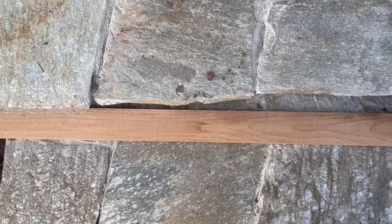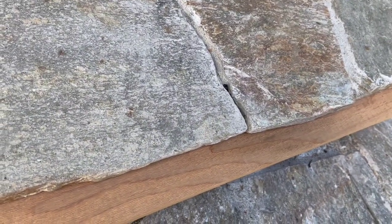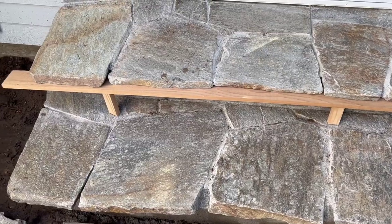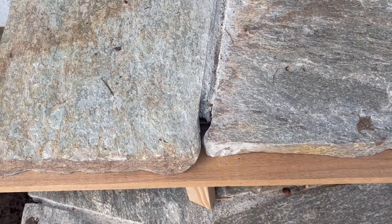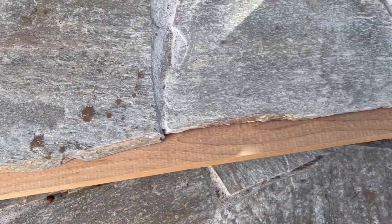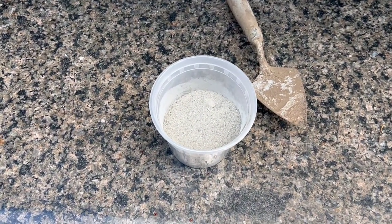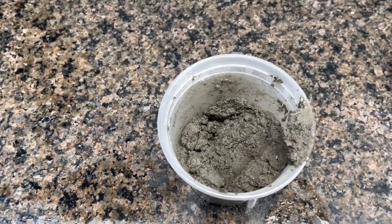What I'm going to do now is take this board and put it up underneath here, then put some wedges on it to fill in these last little cracks with mortar, let that dry overnight and it'll be fine. I just put that board underneath and a couple of wedges to hold it so the mud won't fall through — there's a little bit of a hole there because things are uneven. I'm going to mix my mud a little bit thicker so it's not runny. For this project I'm just using a small cup and adding a little bit of water at a time to keep the right consistency, since we only need a little bit. That's just about the right consistency right there.